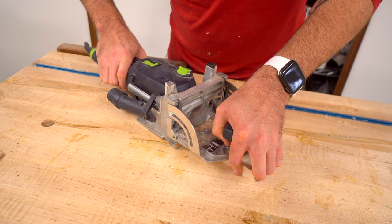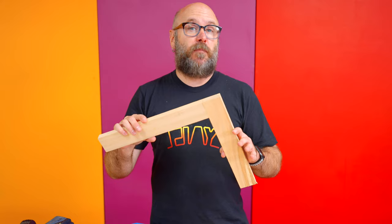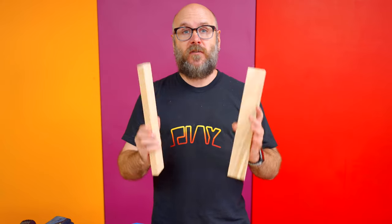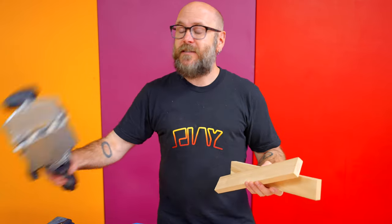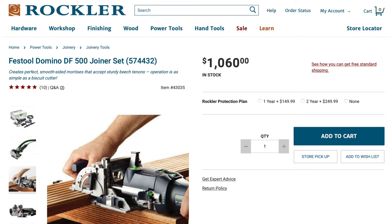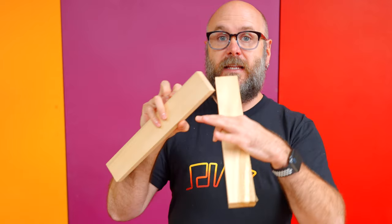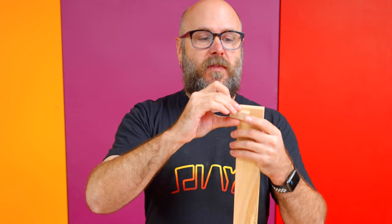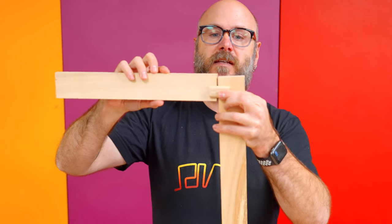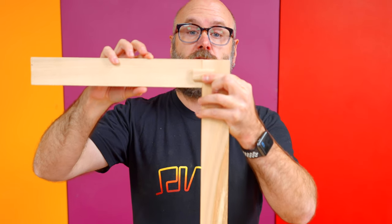The reason I like using the Festool Domino is it's really quick to set up. It's easy to use and it's actually a pleasure to use. But the problem with the Festool Domino is it takes this special tool, which might be out of the budget for a lot of hobbyist woodworkers. The way the Festool Domino works is it creates a mortise in one piece, a mortise in the other piece, and then you have this floating tenon that gets pounded in — and you have a really strong joint.